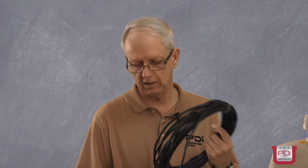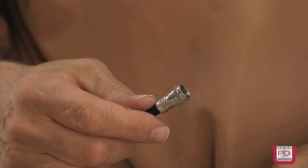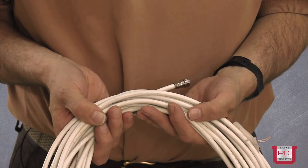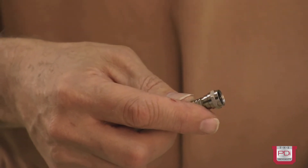Having connected an input signal, what I'd like to discuss now is the style of coax cable used between the central and each bedside location. There are actually two different styles prevalent in the cable TV industry. One is a coax cable that has a steel center conductor with a copper plating. This works great for RF, but keep in mind that the central power supply also supplies low voltage AC power along the same coax. In this situation, the steel center offers a considerable amount of resistance, and we can see issues with voltage drops developing along the coax.